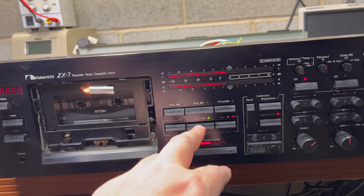Yes, we have sound — okay. Next I'll be trying to see what's wrong: we have a counter problem, a track problem, an azimuth start problem, and something I really can't understand — there are like five volts from a power stabilizer done using a microchip rather than a standard linear power supply. At least we have it playing, and that's already a good sign. You can hear it plays really nice, so tuning is possible. Let me see what's wrong with the electronics.